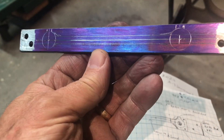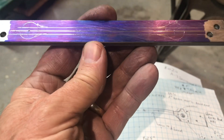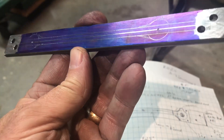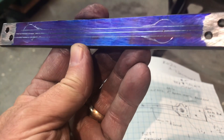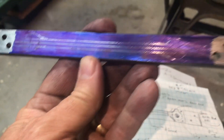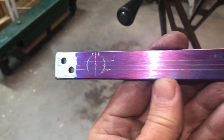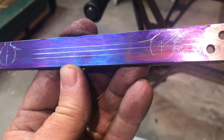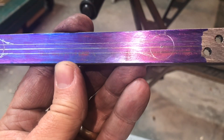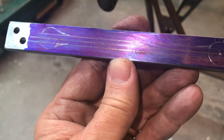Here's the first coupling rod laid out. I used acetone to clean it off completely and blued it with a Sharpie marker. Then I laid out a center line, top and bottom lines for the coupler, and I used my dividers to scribe a nice half-inch circle. I put in lines at the top for the oiler spaces, and then drew connecting lines for the transition between the round part of the end. So there it's all laid out.